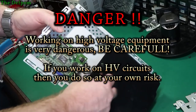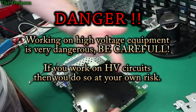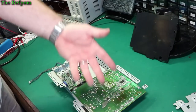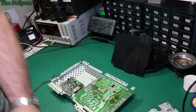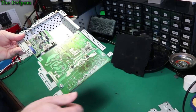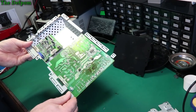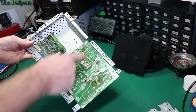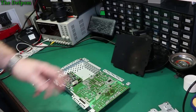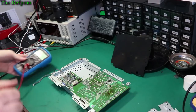Let's get this panel off — it's probably clipped on. That's a nice touch, putting a panel on top so you don't actually touch live circuitry. The power supply is bigger than the logic board. This probably has some power in it since I did plug it in to try it out. There's some discoloration, but it looks more like flux residue. Maybe slightly warmer around here, but that's the transformer so it's not unusual. I can see a couple of big caps here. I'll probe around, check for voltage on caps and discharge. Done the zap myself before — that usually hurts.